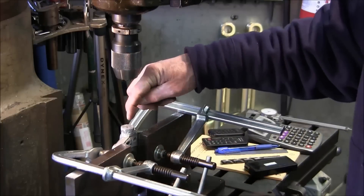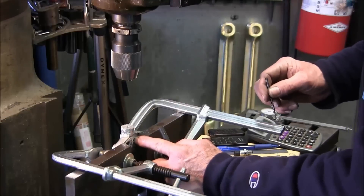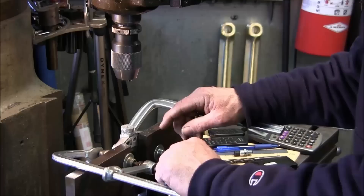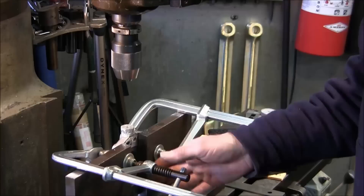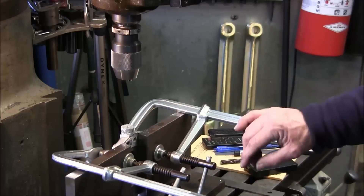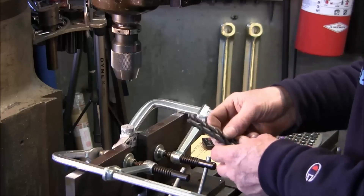After we have that down in there I'm probably going to angle slightly and come in just a little bit closer to this side of the web, because this is almost a straight-end bore. But this one had a rough casting that came in — it wasn't right at the mouth, it was down in there a ways. We were dead nuts on our layout line, but this cavity over on this side is just razor thin — that whole section is only about 200 thousandths inside, though it was about 350 out here.